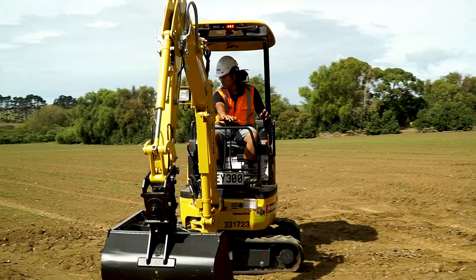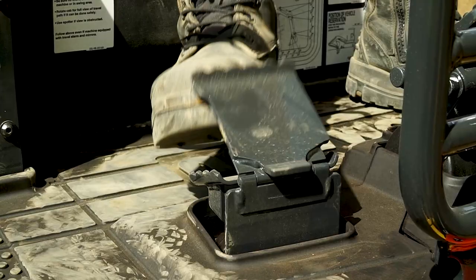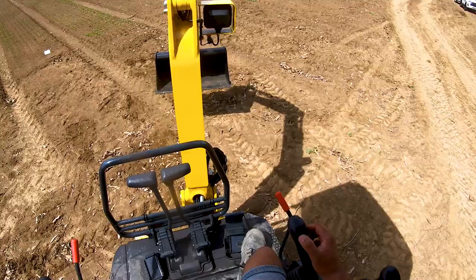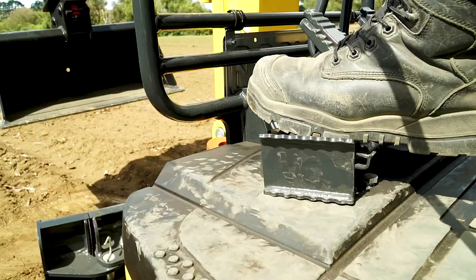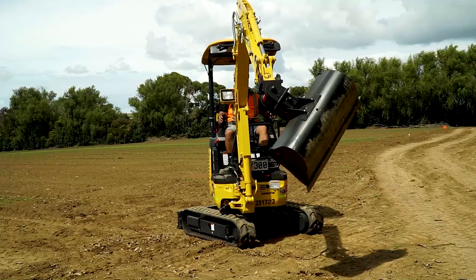Remember, while operating your excavator, if your cab is facing the opposite side of the excavator blade, your travel controls will work in the opposite direction. So take care to pay attention to your excavator direction and environment before moving forward or backwards. There are also two foot pedals which can be accessed by flipping up the tabs — depending on the model, one controls the rotation of the boom and the other the rotation of the attachment.